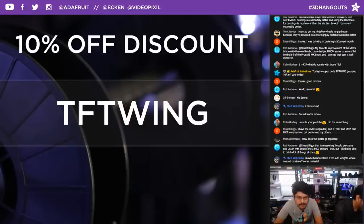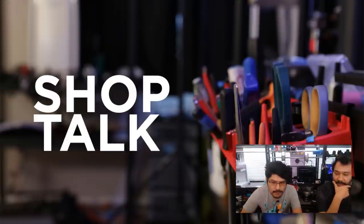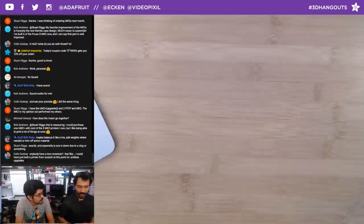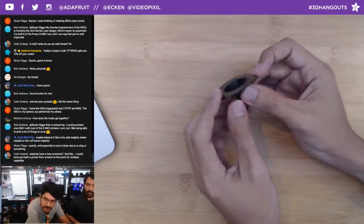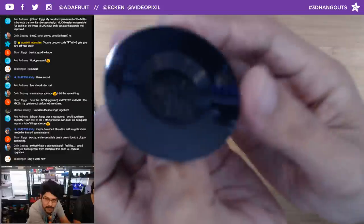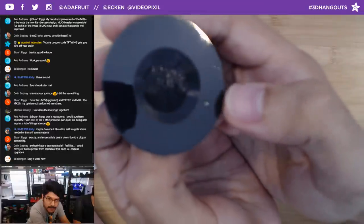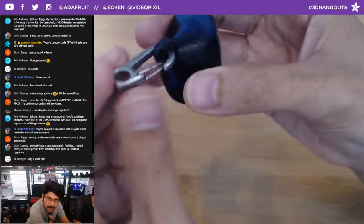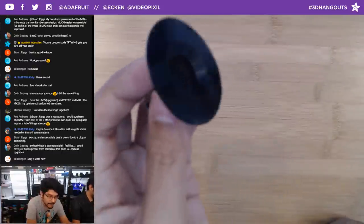This week's Shop Talk: Ninja Flex suction cups. Last week's Lego tape project prompted people — specifically Chris Young — to ask if we could make suction cups as well. We made some with more surface area and a small cup shape, with some overhang — printed with no supports. This was printed on glass and came out pretty good. We're testing out weights: about 150 grams load. It sticks to glass and likely acrylic. The key was getting more flat surface area — that's what actually makes it work. We also tried one printed on Kapton tape for people who don't have a glass heated bed, and Kapton with heat works really well.